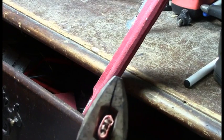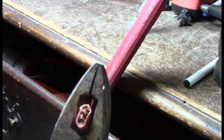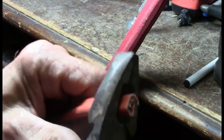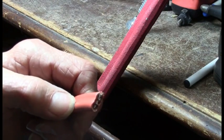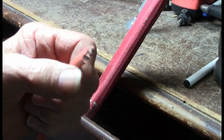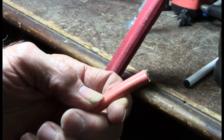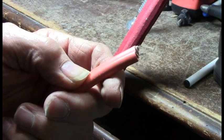Now with two hands you can see we're all the way together — we're touching at the top, and that's what the problem is. I'm probably going to have to add a little bit more weld to it. But you can get through it, and at least they're better than what they were before — they wouldn't even cut. At least now it's doing really pretty good. So you get an idea of what's involved if you want to spend the time. It's taking me about an hour, maybe an hour and a half.